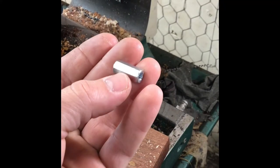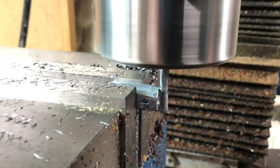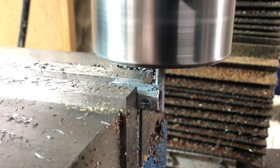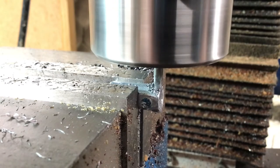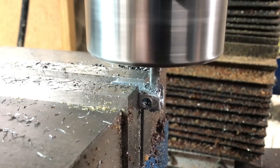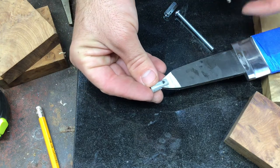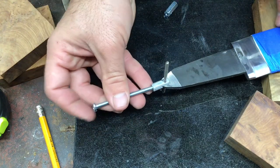The next thing I'm going to do is build a swivel coupling nut. This is a 10-24 coupling nut. I've got a 1/8th inch drill bit that I'm going to drill a hole in one end of it. Then I'm going to take a 1/8th inch end mill and turn the coupling nut 90 degrees and mill a slot in it a little bit past halfway — at least a 1/8th inch past where the hole is. You can do this without a mill; I used to do it with just a sawzall, and then go back in with a file. You can also use a hacksaw. You can see with this thing swiveling on the end of your tang, it allows the angle of the pommel and screw to be adjusted, and it's going to line up every time.